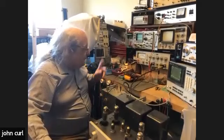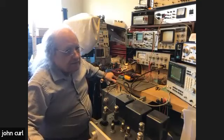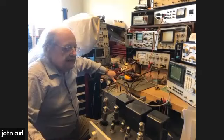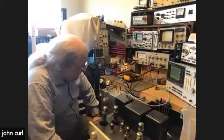Now, so real quick, these are the last questions. What is the topology of the amplifier, SRPP and long tail phase splitter? Who knows? And are the EL34s triode wired? Not in this case. They're ultralinear right now. They actually do both, but I don't have the controller to show you the differences, or I would show you. I have a remote control that can switch between one and the other. To be honest with you, the amount of distortion is about the same, but the triode is always a little smoother sounding. Probably that seventh harmonic would be a little bit lower down. That's probably the difference. Now, I'm going to try to turn this thing on.